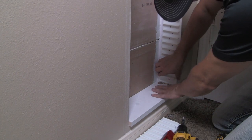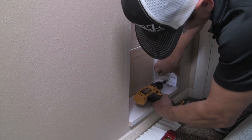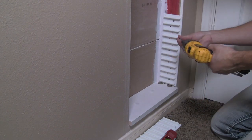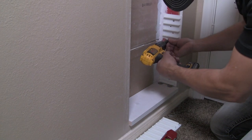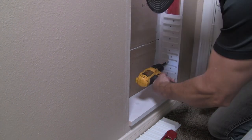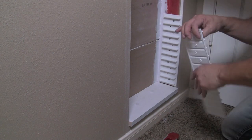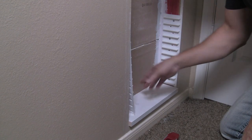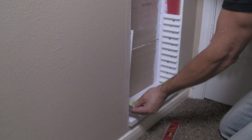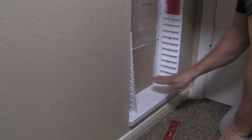Put my finger right here in front to make sure this is flush with the wall. Aim for the center of the hole — that way it looks nice and clean. I'll skip two holes and come in and go to the third one. Do the same thing from the bottom — skip two holes. Now if you're going to store super heavy items, then you can put more screws. We'll install the next one. I recommend you cut a piece of board to fit across there, then use your level to make sure everything is level. That board I would say 14 inches — it's actually 14 and an eighth, but I'll give it an eighth less just to allow it to go in and out easily.